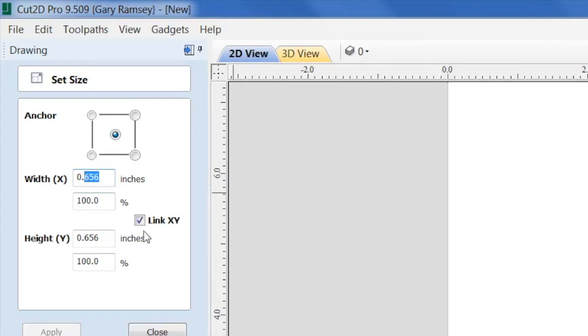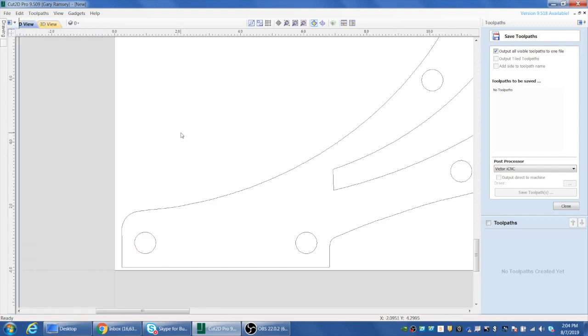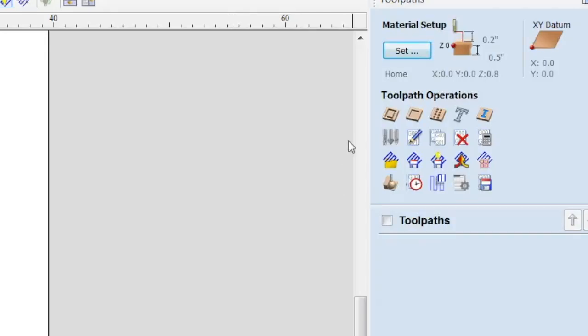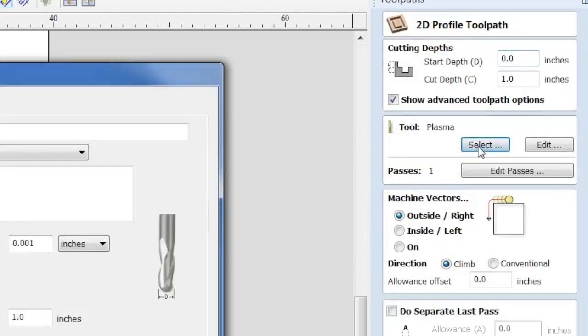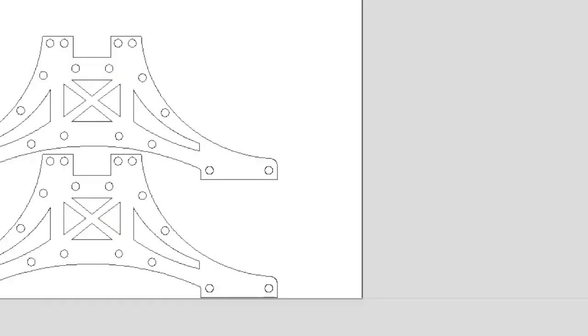These are clearance holes, and you can make it even bigger if you wanted to. I'm going to make it 0.675 and apply that to all of them. Then we're going to create a new toolpath by clicking on the toolpath operation. Under spindle speed, we're going to run at 50% - that's a speed reduction on our machine by 50%. Whatever it would normally cut quarter inch plate at, say 80 inches a minute, in this case we'll slow it down to half speed.